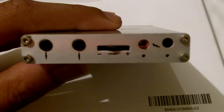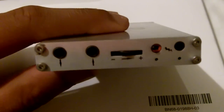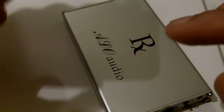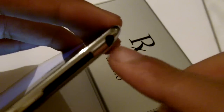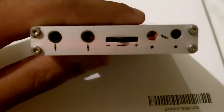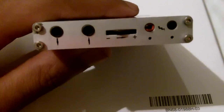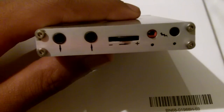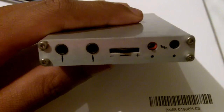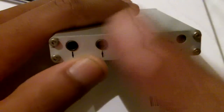It's not recommended to use a cable with two 3.5mm jacks and plug it into the headphone out of the iPod and then into here. What you're doing is amplifying the already lower-quality amplifier in the iPod — you're amplifying an amplifier. So basically you've defeated the purpose of getting a higher quality amplifier. I'm going to get more into that and why that's not a good thing to do.